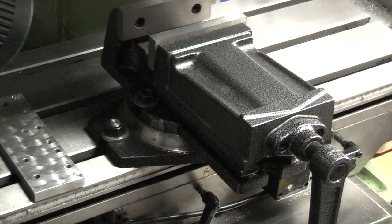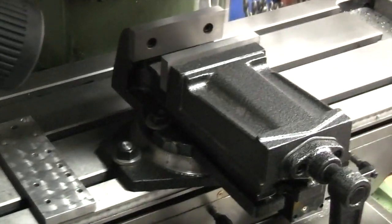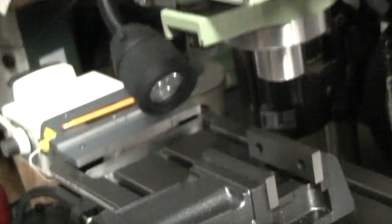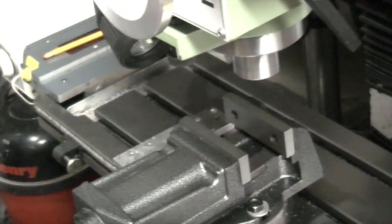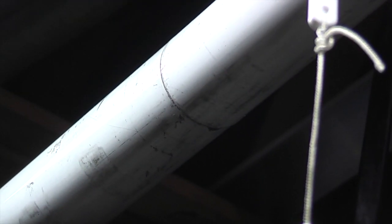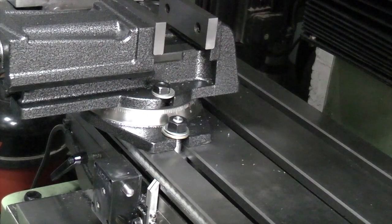I'm holding the camera in the device. I can swing the camera around on the ball joint anywhere to get the picture. I can move the pole anywhere from level with the device, or move it up to give a higher position and swivel it. The pole is actually an aluminium tube — two pieces about seven foot long. There's a joint between the two pipes: one pipe has a spigot, the other is a plain bore. There are two O-rings on the spigot, and it's just the pressure of the O-rings in the bore that hold the two pipes together. It was originally used as a flagpole for an automotive dealer.